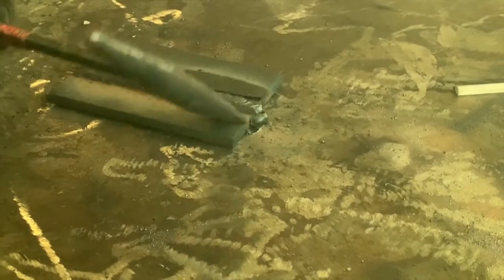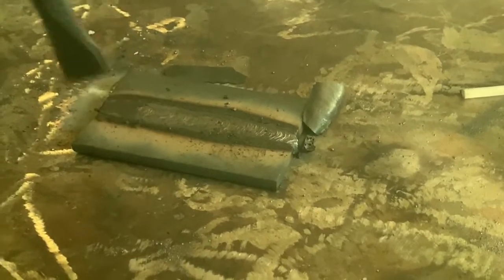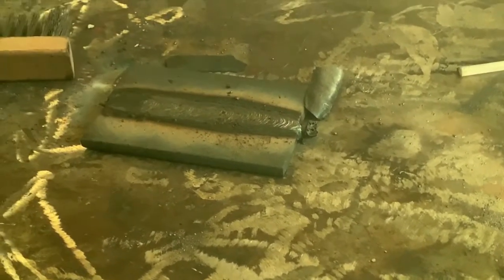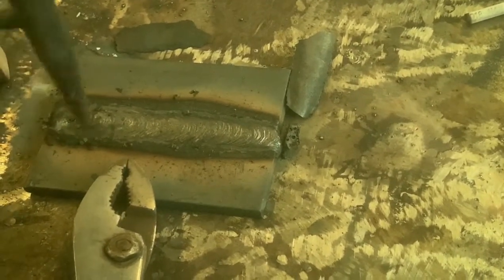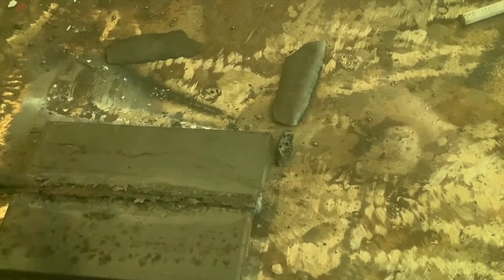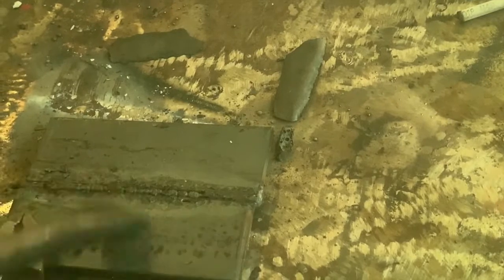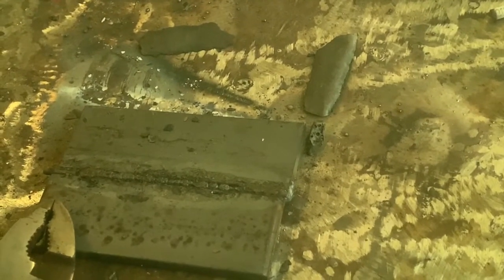Just kind of give it a little help here — we're not really beating it, we're just sliding it right off. You can see a nice little even ripple. Take our brush and clean it up. And we'll check the back for even heat marks. We've got a little bit of melt-through along with the flux that burnt through, making that slag that just slides right off. Good heat, good penetration. That's a 7018 butt weld in the 1G position.